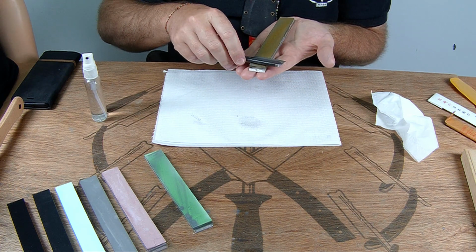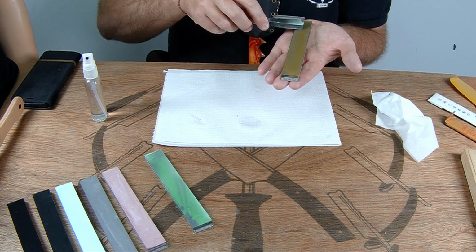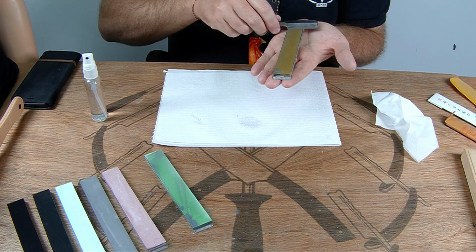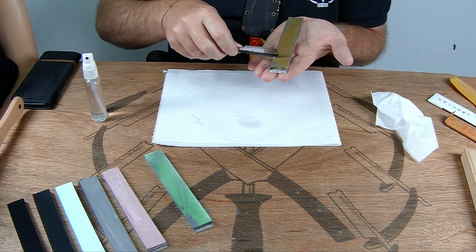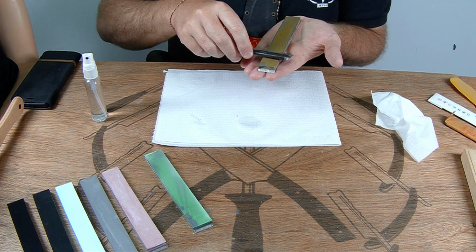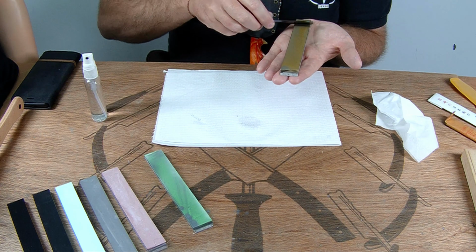So now you've established all the right 2K scratches here. And on each of the stones, it kind of does that, especially at these lower grits, 1K, 2K, 3K. The 5K and 10K, not as much, but you just get into this place, and it's hard to stop sometimes because you're like, oh, that feels really good. It's the zen part. But I think at that point you've actually matched up all the scratches without missing anything, so you have the most contact at that grit. All right, we'll check it and get ready to move on.